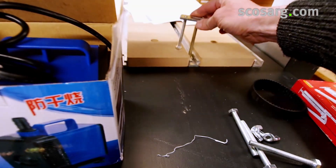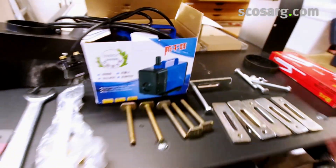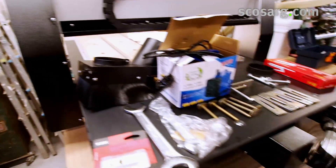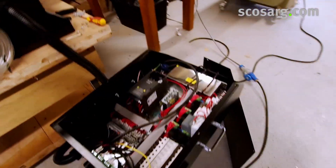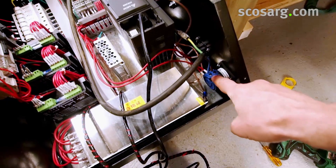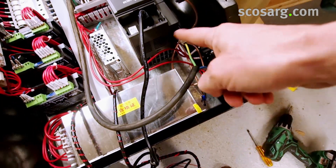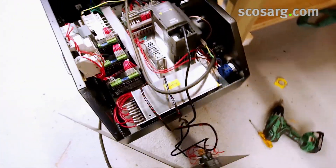You need a packing piece on the back to prevent damage to the table, and a water pump because it's got a water-cooled head on it. We've wired it up so the wiring goes to the isolator — L1 and L2, and then Earth just to the ground — and then we're ready to go.